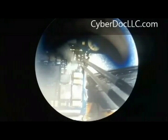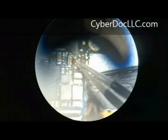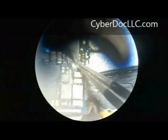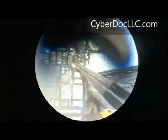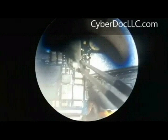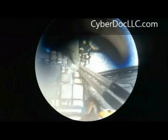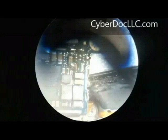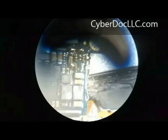Now I'm just trying to get the alloy onto all the pads. That pad is not holding the alloy too well because it has a little bit of plastic from the IC that's blocking my heat transfer. So I'm just working on that right now. You have to melt the existing alloy and clear off that little part. I think the alloy got out. Now what you see is a bridge between the coil's pad and the capacitor. This is what happens when you use the quick alloy desoldering alloy — it can get all over the place because it's very soft and almost liquid.